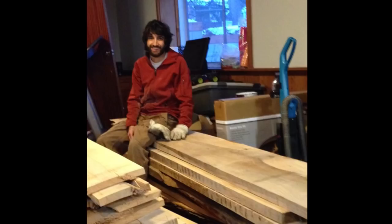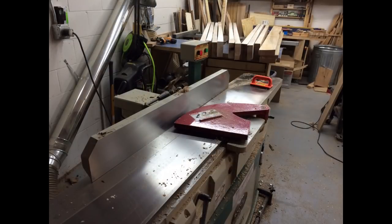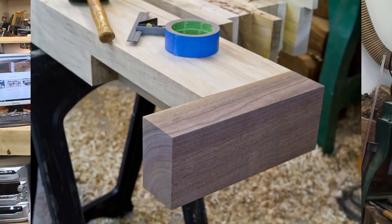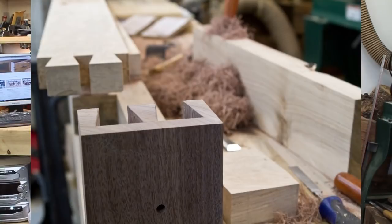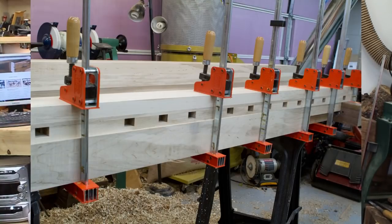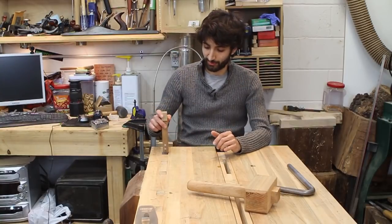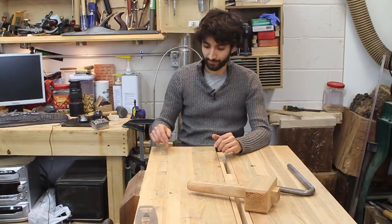When it was time to build the bench, I had ordered the Benchcrafted hardware kit and had to dig the boards out from the bottom of my lumber stack. My wife helped me carry them out and we started cutting them into strips, which took a few hours just for the top. The hardest part about making the top is the front slab by far — there's a lot going on. The end cap gets a tenon, the front laminate piece gets a dovetail that goes into that end cap, and you have the dog strip with all the dog holes. I probably put about eight hours into making square dogs, whereas round holes would take about an hour. The dogs have a little piece of wood that acts as a spring so they stay raised in the slot.